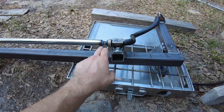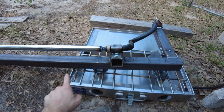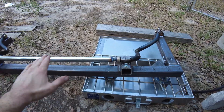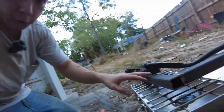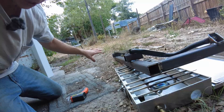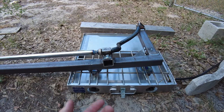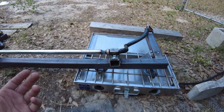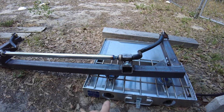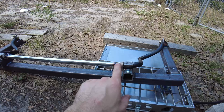But the ones at the bottom, assuming we weren't preheating, would be close to one another. So if you're welding up top, those molecules start far apart while welding, but as the weld cools they contract. If the bottom part isn't moving and the upper part is contracting as it cools, you'll get the whole jig bowing. I used square tube on this jig specifically to counteract that bowing — square tube is inherently good at dealing with bending. In essence, welds get really hot and as they cool they contract, and that cooling leads to warping.